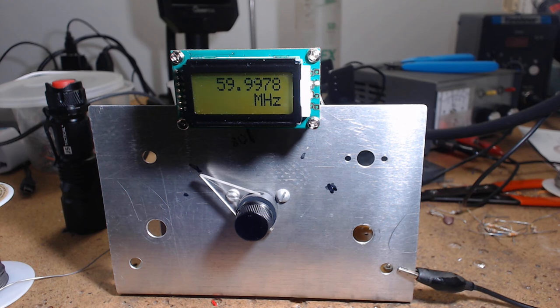Whatever was drifting has settled down. I could get my HP frequency counter out to find out whether it's that frequency module drifting. I would put the frequency module on the HP frequency counter, let it all warm up, then turn the oscillator module off and let it cool down, then turn it back on without turning off the frequency counter — scientific method. If it moves, I know the reference oscillator module drifts for say five minutes when first turned on, so I'd need to wait five minutes before chasing drift caused by something else.